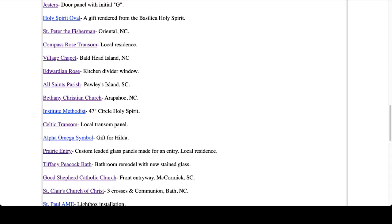Years ago, they did a lot of work with solid zinc H channel, which I believe Cascade has. Every piece that was cut had to be cut with a miter saw or a hacksaw, and then with the brass crown lead. But when these windows were done, they were solid. So a lot of the older beveled glass windows were done that way, because they didn't want the reinforcement. Actually, that reinforcement was the zinc.